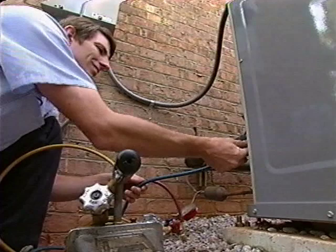Actually, bigger is worse. Oversized units can cause a number of comfort and service problems. What happens when we oversize our equipment is that we have shorter run times and what we call short cycling. In our heat pumps and our air conditioners, the system gets its maximum efficiency after it has run for a certain amount of time. Depending on the piece of equipment, that could be 10 or 15 minutes before it gets to its steady state of operation.